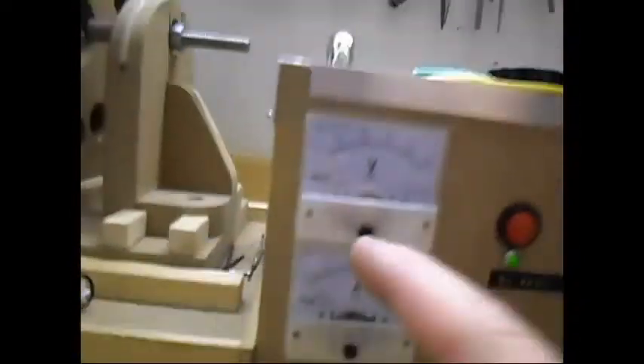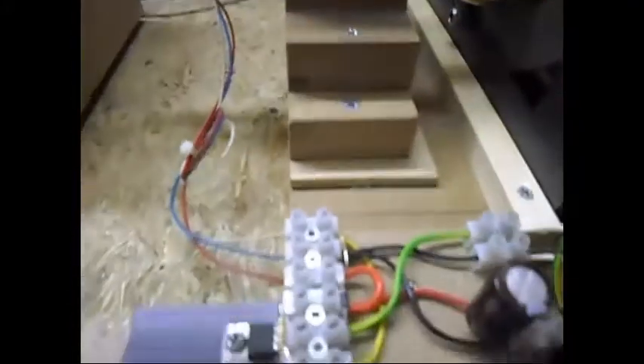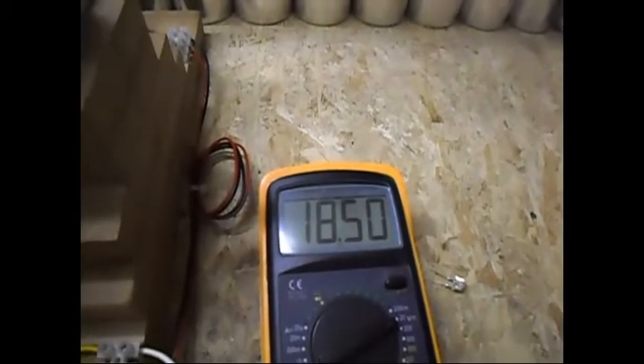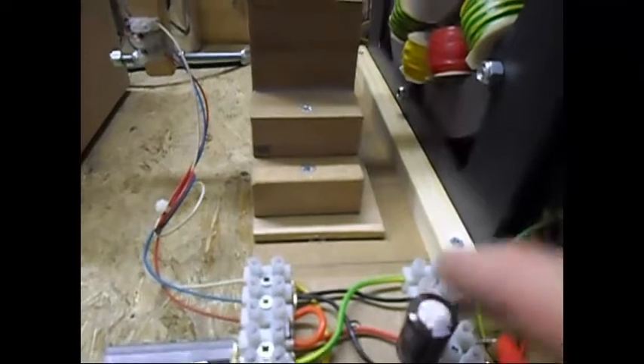At this moment I am running it. I am going to measure it with this — here the voltage is 250 millivolts, so it is showing like 20 or so. But over here, if I measure it at the source capacitor right over there, it is now sitting at 18.50. The reason why it is fluctuating up and down is because I have a diode over here, so the back EMF is going back to that source cap.